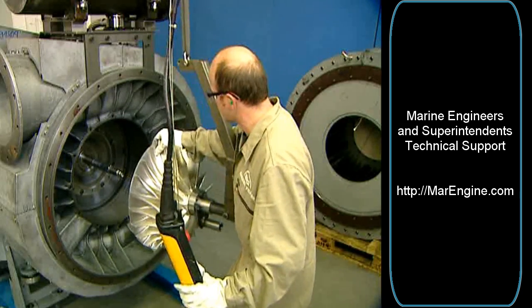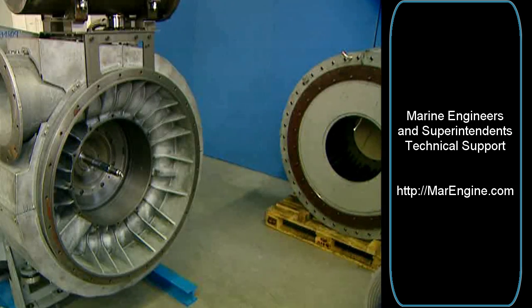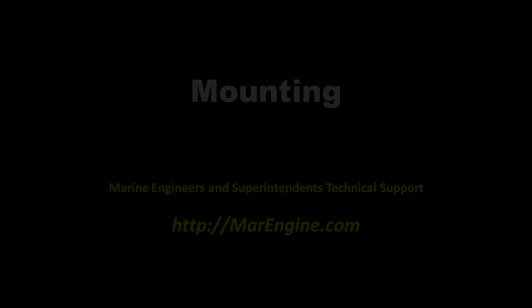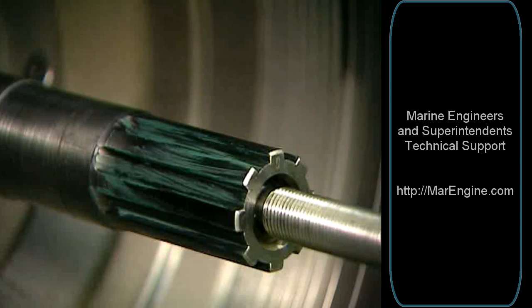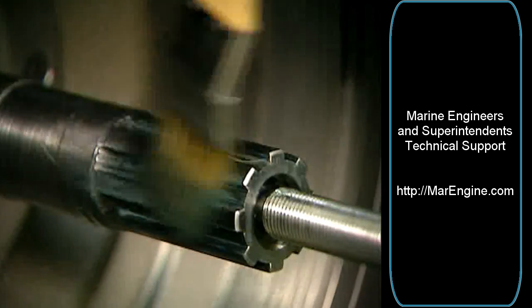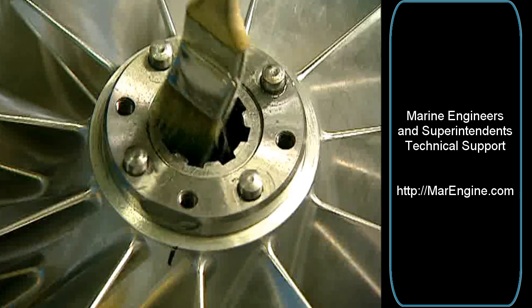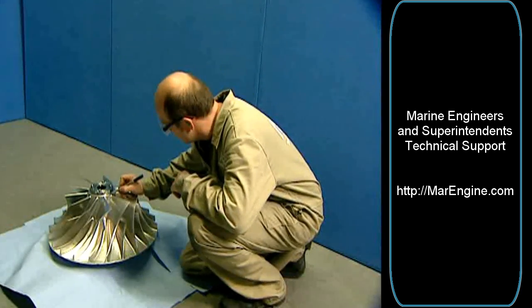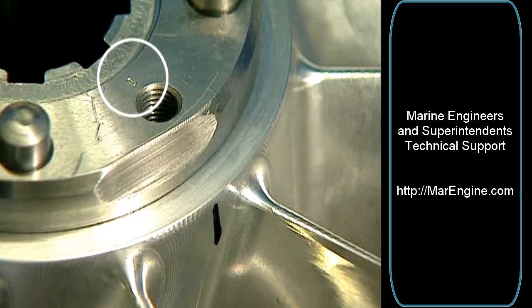Place down the wheel onto a wooden support and remove the suspension device. Clean the splined profile on the shaft and in the compressor wheel thoroughly. Copy the balancing mark of the compressor wheel to its inlet surface.